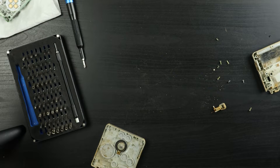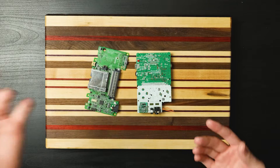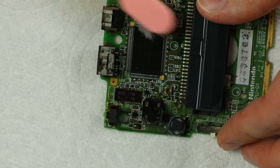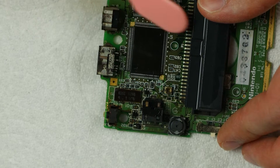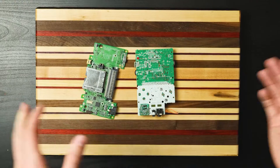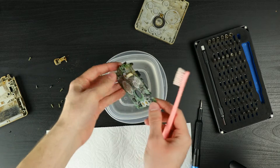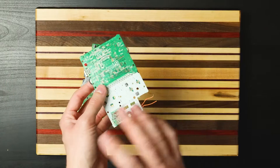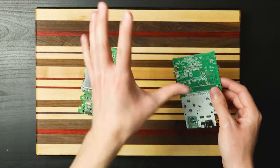What started that process was my mom's ultrasonic cleaner. The SP was small enough to fit in the one she has for her jewelry, so I borrowed it and it worked. It didn't fix it immediately, but it cleaned a lot of the dirt and grime off. Ultrasonic cleaners are actually meant to shake the rust off metal, which is crazy. Paired with the right cleaner, it can really get PCBs clean. I know what a lot of you are thinking — you're not supposed to get electronics wet. That's true, but if there's no power connected, no speakers connected, and you don't turn it on until it's completely dry, it's fine.